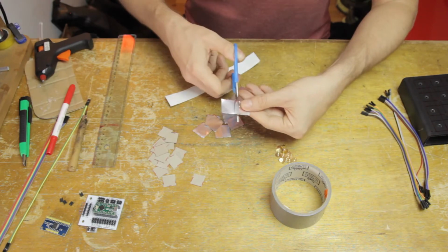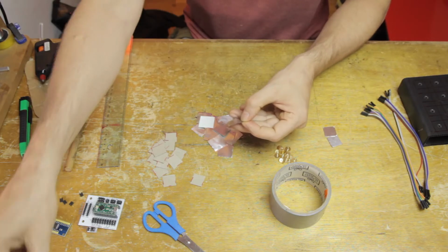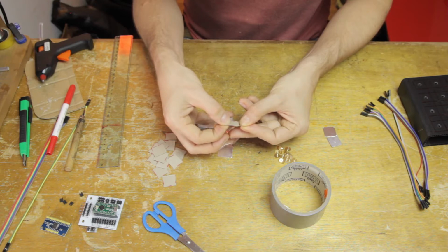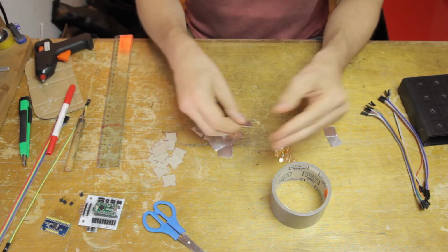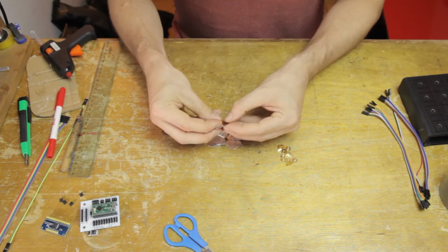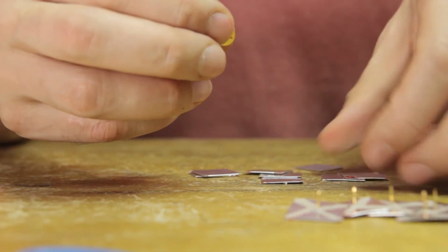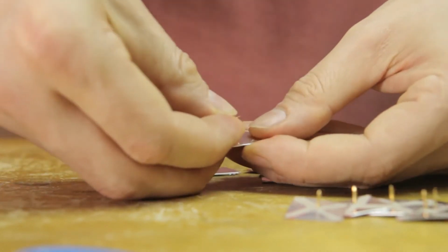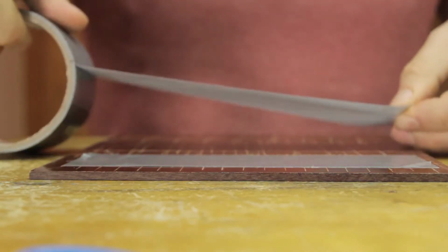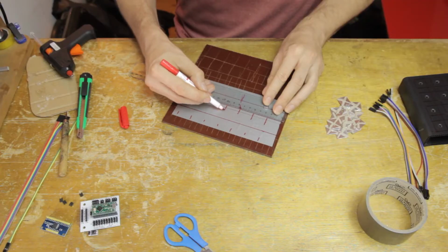And I want it to be a little bit tactile, so I'm making these square cardboard pieces, and I'm going to put the aluminum tape on those, and that's going to raise each pad slightly off the surface of the instrument, making for a more tactile surface. Good. So now I have these square pieces of conductive pad, and I'm going to put my thumbtacks through those. The thumbtack contacts directly with the metallic tape. There's no soldering involved. We're just going to plug the thumbtacks directly into the DuPont cables. So this is a very simple construction technique.